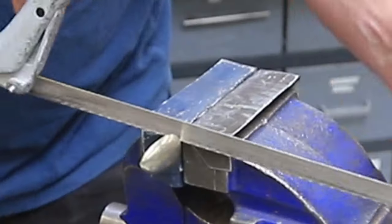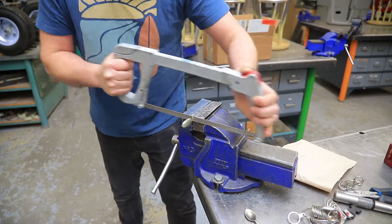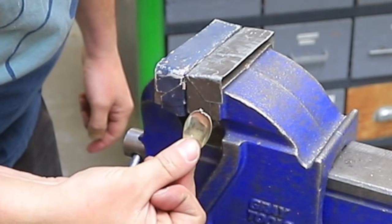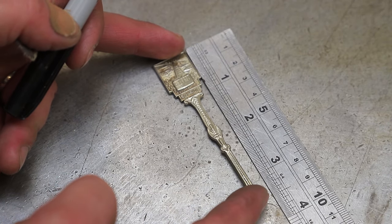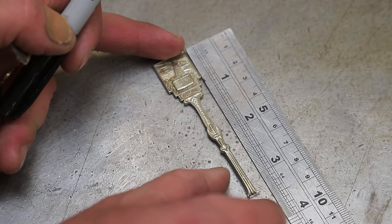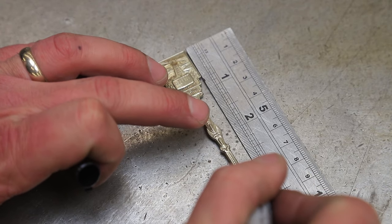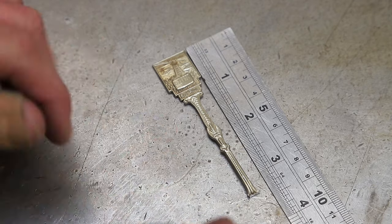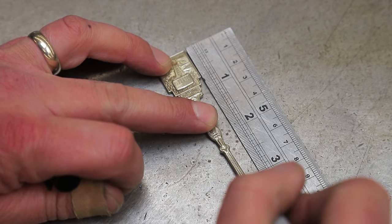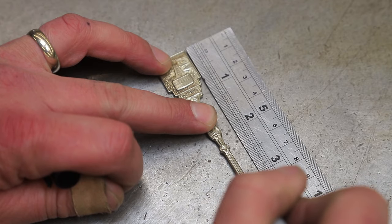I'm cutting a little bit bigger on purpose. Now I've got roughly three and three-eighths of an inch of material. I know that's gonna be overkill so I think it's safe to trim a little bit more off. If I go exactly at 2.7 inches there's a chance that as I bend it it might not be big enough, but I think I'm probably safe to do it at around three inches, or about seven and a half centimeters.